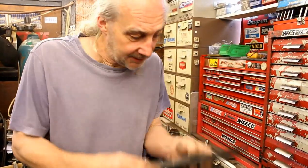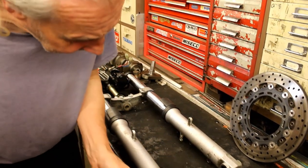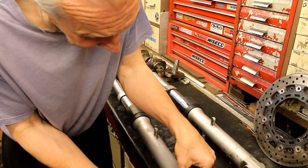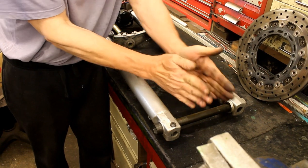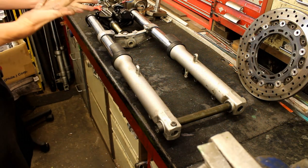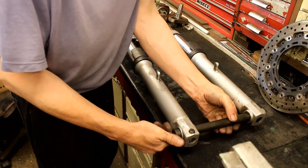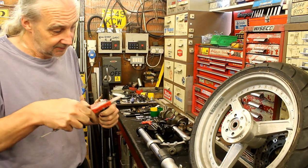That'll just come through anyway so it doesn't matter. It might just work - if that goes through a bit more it just means the spacer in here might be just sunk in a little bit. It's also massively thicker than a standard setup on an old Z1, so there's going to be no problems with the spindle. I'm glad you're here - let's just take those forks and the front wheel and see how it fits. The bearings are too small - I bet it's 25mm, actually it's 22mm.